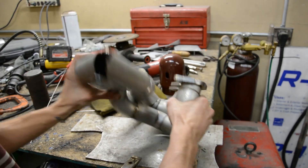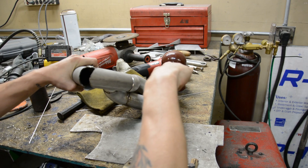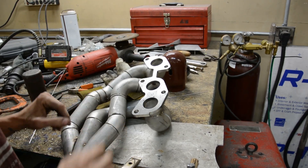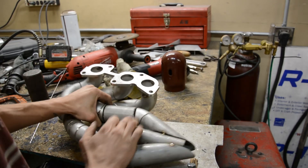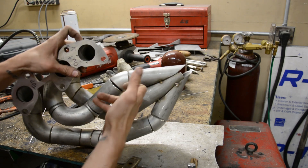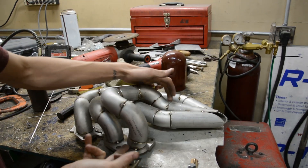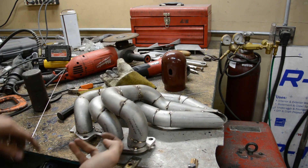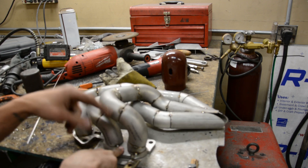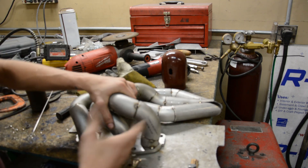Along with welding it, I want this part here to just sit a little bit lower. So I'm going to pull the flange off and shave all of these at a bit of an angle — we'll just rotate it down, and it should give us enough clearance. You can see there's one big gap right here that's going to be a little tough to fill, and getting inside those deep ridges will be tough too. So I'm planning to split it here and here to get the middle runner out, then split the others off, shave them down, and weld them back onto the flange to keep them flat. The flange is going to be on a heat sink, which will hold it flat and suck some of the heat out.